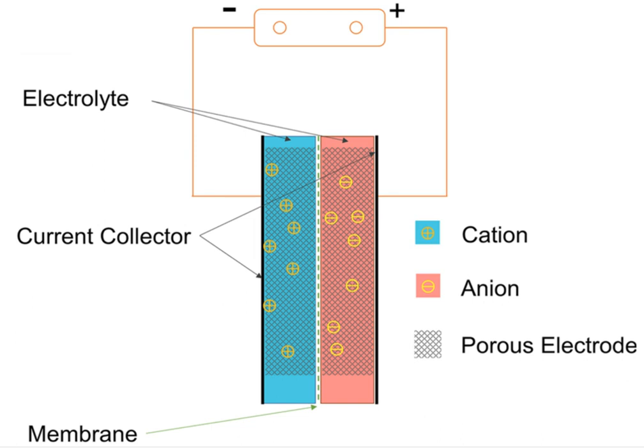These double layers consist of two layers of charges. One electronic layer is in the surface lattice structure of the electrode, and the other, with opposite polarity, emerges from dissolved and solvated ions in the electrolyte. The two layers are separated by a monolayer of solvent molecules, e.g., for water as solvent by water molecules, called inner Helmholtz plane (IHP). Solvent molecules adhere by physical adsorption on the surface of the electrode and separate the oppositely polarized ions from each other, and can be idealized as a molecular dielectric.